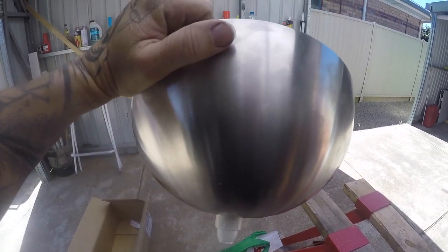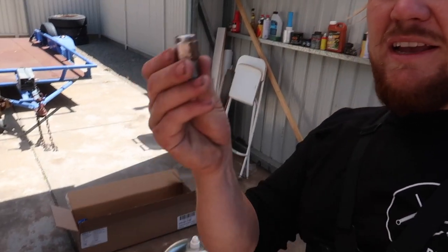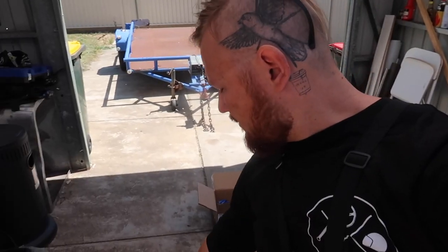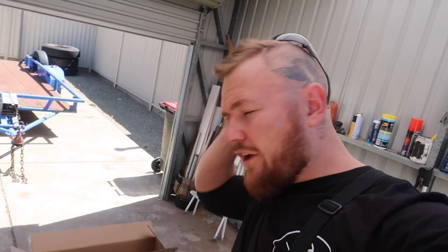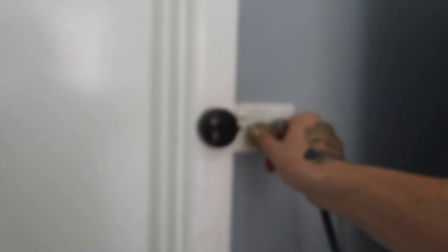For the base weight to hold down the lamp — I don't think Taylor's going to like it, so this is just going to be temporary until I can source something a bit more flashy. Going with the scrap character, I've got a Mark II Escort hub and this nut — I'm going to weld it onto the first pipe so it can screw straight on and be disassembleable. It can be taken apart and in the future I'll do something nicer. We'll crack out the SWS alum TIG 200 and TIG them together, and that'll be most of the welding done before we run the wires.